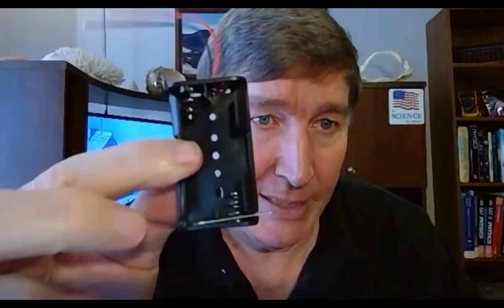The H bridge, if you look at the spec sheet, says that whenever you connect a big battery to it, that big battery should be 4.5 volts or higher. So don't be surprised if you try using this as the big battery on your H-bridge and it doesn't really work right, okay? The best thing to do is to get one of these. So what I did over the weekend is I bought a bunch more of these and I took them into the Ames office and I gave them to Nancy. So if you go into the Ames office and ask her for one of these, she will give you one.